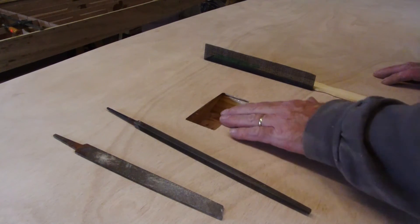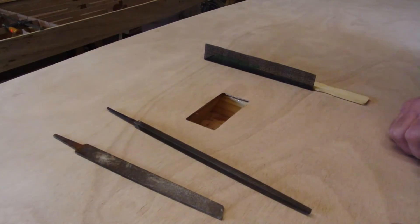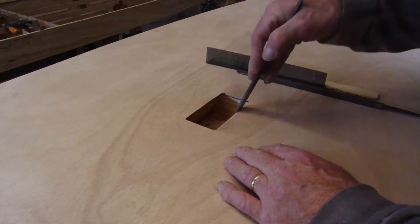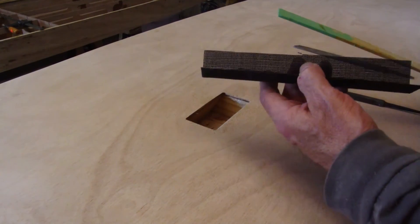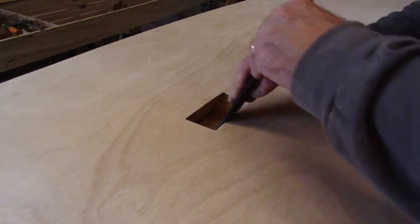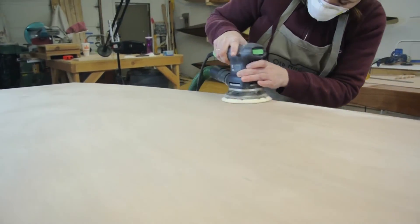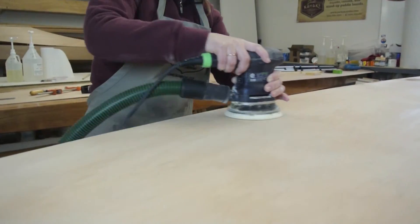Use a wood rasp or a heavy grit sandpaper to smooth any epoxy that squeezed out around the handle opening. You should also round over the edges of the opening to make it comfortable for your hand. Check all the wood joints including the edge of the deck, the bottom panel, the transom, and the bow for any gaps where epoxy didn't squeeze out and fill the joint. Mix up a small batch of thickened epoxy and fill those prior to setting the fiberglass.